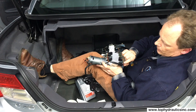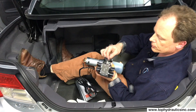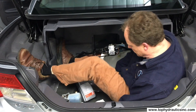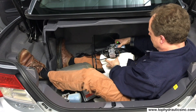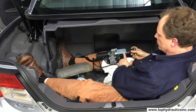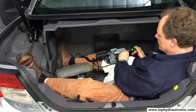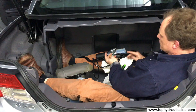What's left to do is take out the emergency release cable and pull out the hoses. To take the hoses out there are T20 bolts — each bolt holds two hoses in place. Just unscrew the bolt and then pull out the hose or hoses. There are usually two hoses with each bolt.